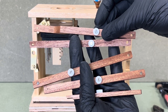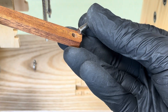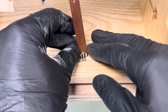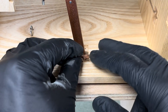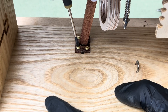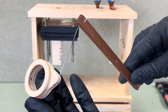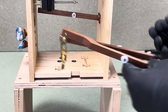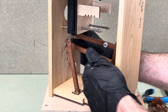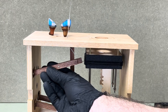There are five cam followers in total, each mounted in the same way. I started by inserting a shaft into the lever of the cam follower with two washers placed either side to prevent lateral movement, then positioned the assembly in the box and secured it with brackets on either side. One follower controls the cannon's rotation — before installing it I attached a collar via a wire linkage. Two other followers work together to operate the fuse, and another pulls the cannon ball back into the barrel. The final cam follower, fitted with its own linkage, animates the pirate's arm.